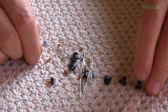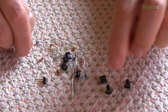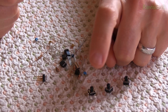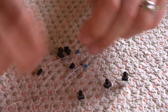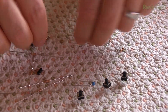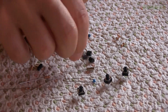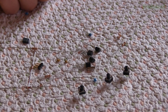There are three microswitches. One is used to advance the hours — you just click it until the hour meter says the right thing. Another button does the minutes, and you click it until the minutes needle is set to the right point. And then there's a reset button — not necessary, but nice if you're doing Arduino programming on the chronulator kit and want to reset when loading new code. There's also a whole bunch of resistors that go into the current source, a couple of capacitors and the crystal used to generate the 32.768 kilohertz clock for timekeeping, four transistors for the current source, and a couple of general-purpose decoupling capacitors to keep noise on the voltage supply down.